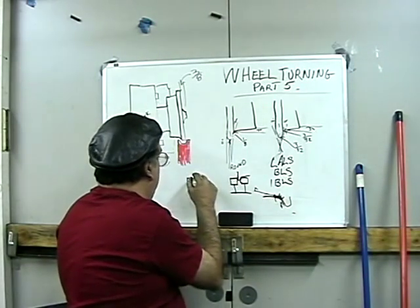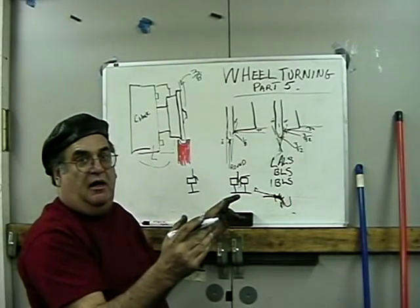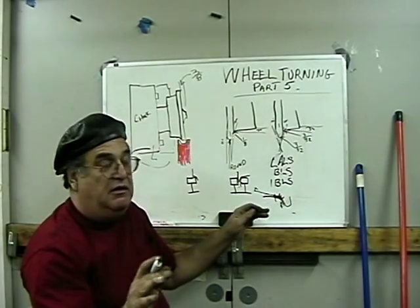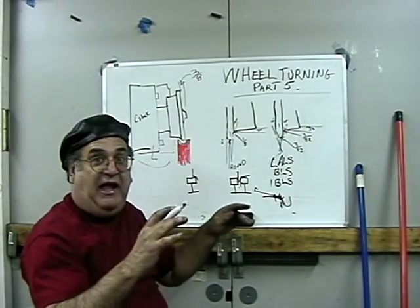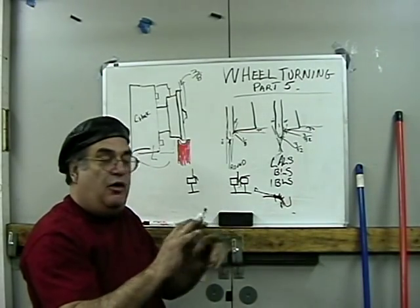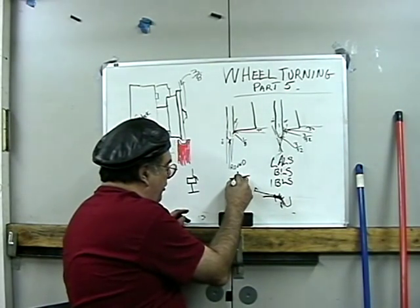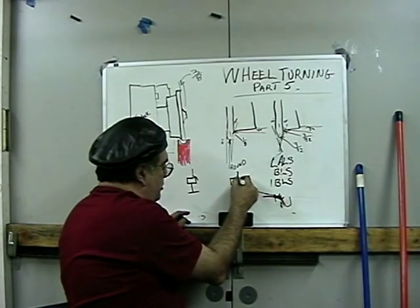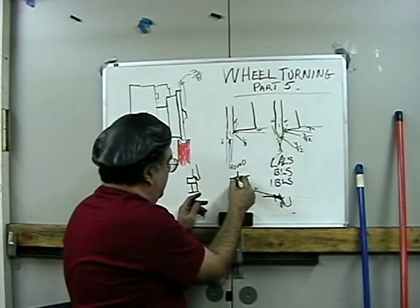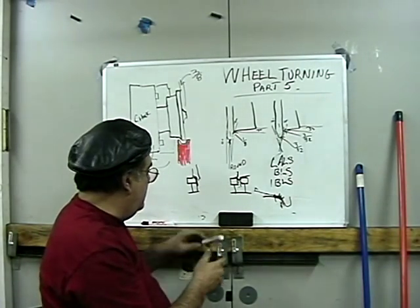On the back, straight back here, this is going to — if your guard rails are good, if you maintain that gap, whatever gap you decide — let's talk about this: how could you have a wheel standard without a track standard? There's no track standard, nothing, and there's no rail standard. The railroads have an AAR rail standard for the shape of the rail head, but we have nothing like that — all kinds of different rails all over the place. Properly it should be the guard rail holding it back here. If you have 10 degrees, it's going to push over more and cause issues at the points, but if you pull it over with the straight part and maintain the guard rail, you'll have plenty of gap and won't pick anything.